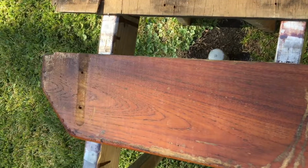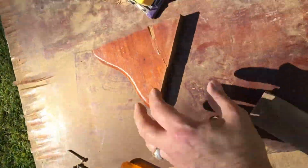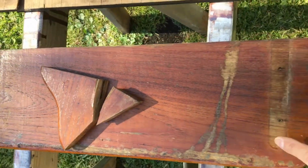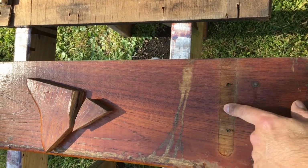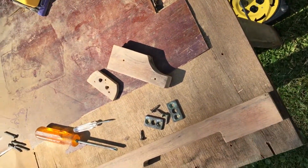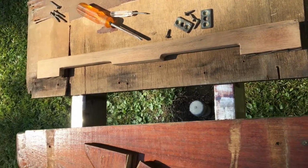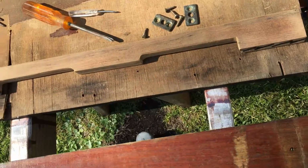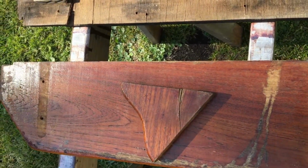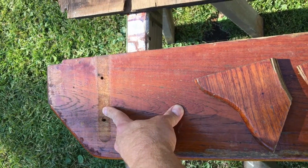The next problem that we have is this is one of the stair treads, as you can see the grip, but it was the one that was at the top of the bottom companionway stairs, and it failed. So here's the stair tread that broke apart because this side, which is still in the stair riser, is still in good condition, but the plywood that was holding the bottom stairway up delaminated, and of course the top tread, the three bolts that hold the stair riser to it, see, there's three holes on the side, came out of the plywood, twisting the stair downward, and that snapped the only secured stair riser on this tread in half.